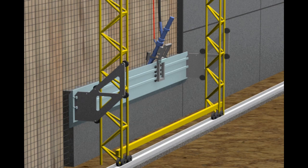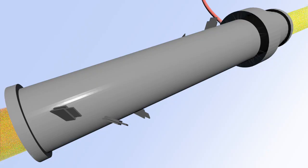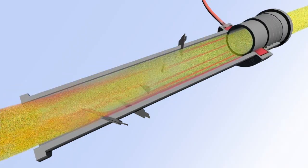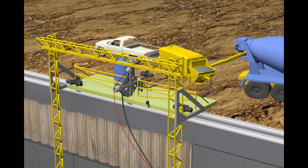How is this possible? A dose of a new thickening admixture is injected into the concrete. The inline mixer is designed to optimize intermixing with a series of staggered spikes that disrupt the flow of the admixture away from the periphery. A concrete vibrator is located on each side of the concrete placement nozzle to assure consolidation, on top of any surface vibration system.